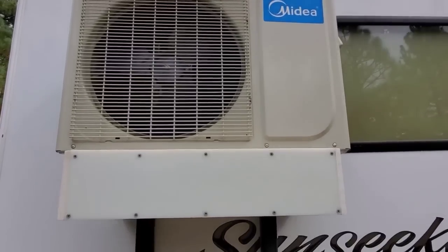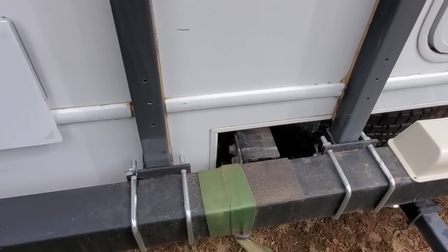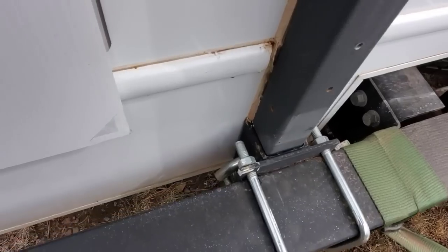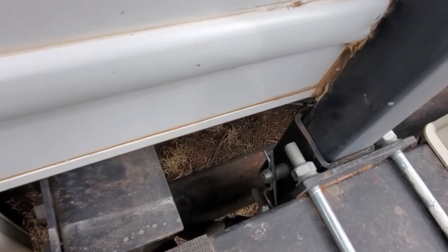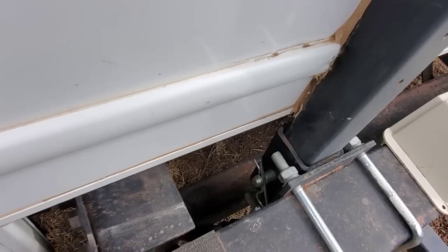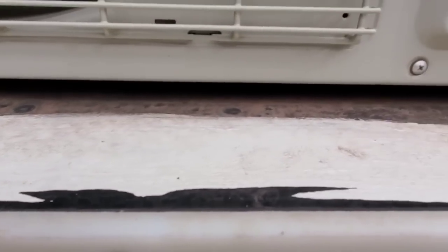I went to Amazon, bought 2 bed extenders. These are pickup truck bed extenders. Normally these are put into the receiver hitch of a truck, which allows it to carry longer pieces of wood. So what I did is I took these 2 L-shaped 2x2 beams and I mounted them vertically into 2 4-inch bumper receiver hitches. I then mounted a piece of UHMW plastic to the 2 L-shaped beams, and then I mounted the outside unit on top of that using the 4 carriage bolts supplied with the unit. This makes the unit very solid and stable.